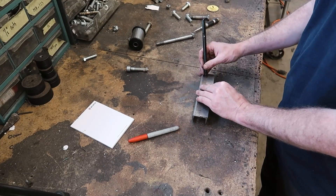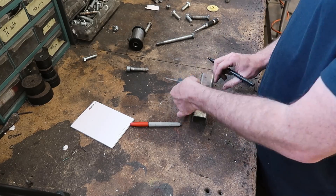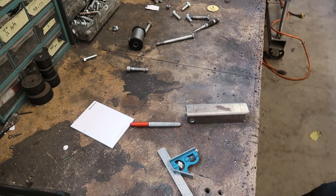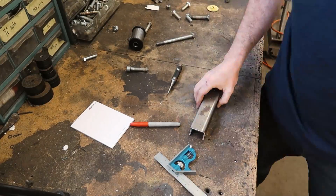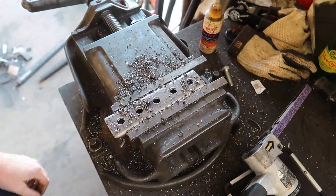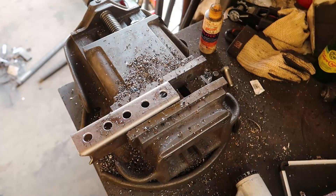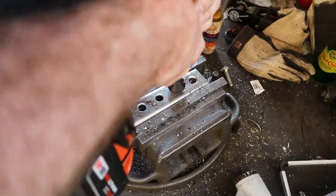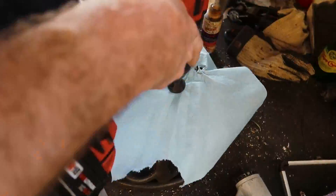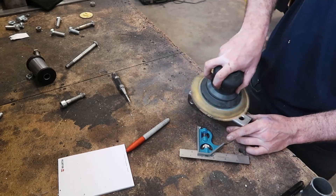After some measuring, I decided on one and a quarter inch spacing with three quarters of an inch from each end for my holes. This gave me five equidistant holes that were also equally spaced from the ends of the part. After drilling these out, you'll see me using a chamfering bit just to decorate the holes a little bit and make them visually interesting. The bit I chose isn't quite the right one for this job so I may go back and clean these up more later, but overall it came out looking pretty good. I then DA'd the part and used Scotch-Brite to clean it up.